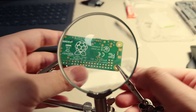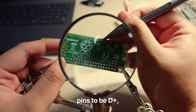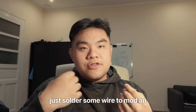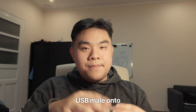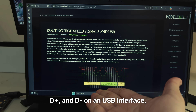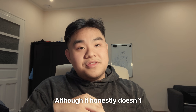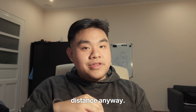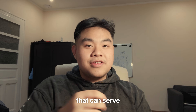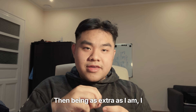Look at these little pads on the bottom. After a little research on the internet, I found these four pins to be D+, D-, 5V, and GND. Using this knowledge, we can just solder some wire to mod a USB male onto the Raspberry Pi Zero. But if you know why there's a D-plus and D-minus on a USB interface, then soldering random wire is not a thing you should do, although it honestly doesn't matter over short distances anyway. Since I want to make this a good-looking device that can serve more tricks in the future, I just bought a shield online.